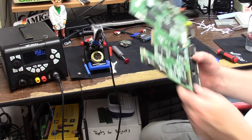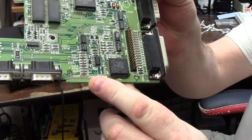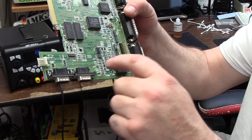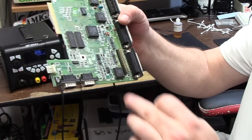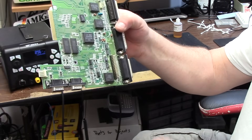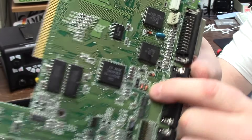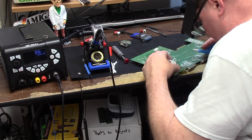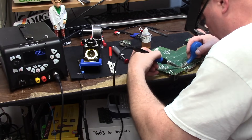Okay, so far working backwards — we got the busted line negative that I found here. We're going to fix that. These are a series-based cap: positive-negative, so negative goes to the positive of the other one. 303 to 304 — negative of C303 goes to the positive of C304 and these are your joined outputs. Up here is really crusty. I fiberglass-penned it — you can see it's nice and shiny again. Flux the living crap out of this area and try to pull the solder out of this ground plane.